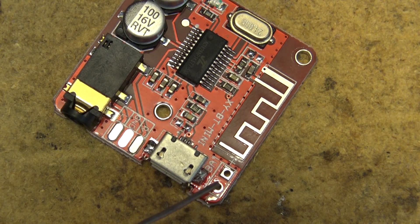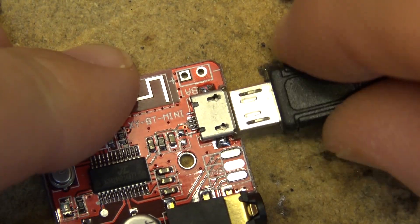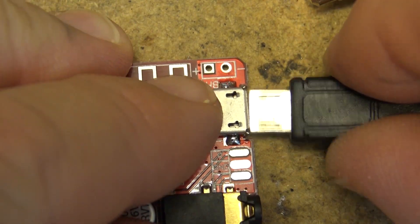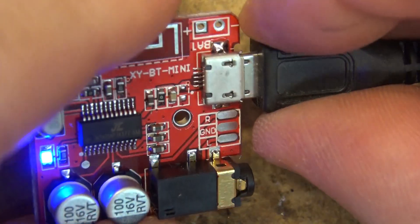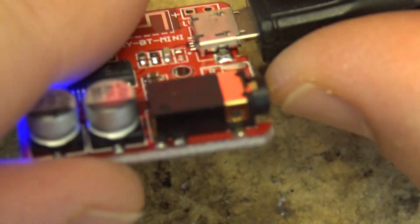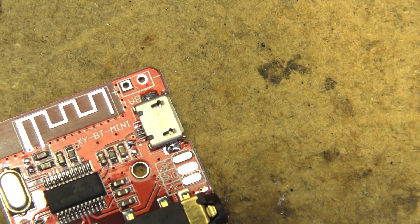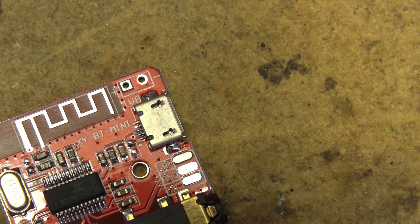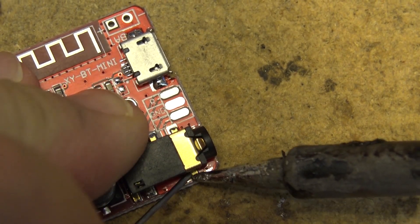There — that will prevent that connector from coming loose. It's on nice and tight now. I noticed it was coming a bit loose when I was moving it around with the USB cord, since it's quite a heavy cord. So if you get one of these, you might want to double-check that the terminals are soldered down nicely. These other ones look like they might need a bit of rework too — which is quite often the case with surface-mounted parts reflowed through an oven, where larger components don't always get tacked down fully and need to be done manually.